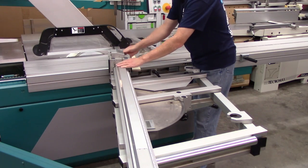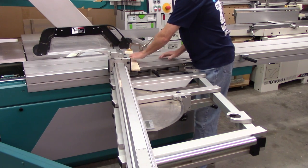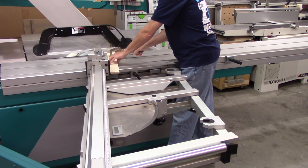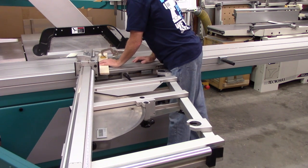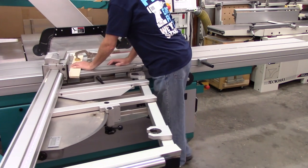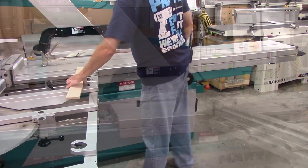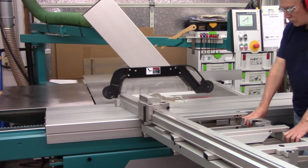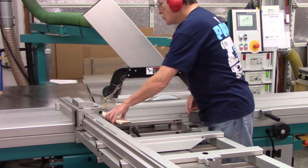So now I'm at the miter, and if you've watched my slider series, you've seen this. I had a battery exhausted failure in the middle of the videoing on this portion of the project, so I stole it from another video. Here I'm cutting the wild end on the compound miter. The blade is set at 43.1 degrees and the fence is set at 14.51 degrees. This is the opposite side cut.